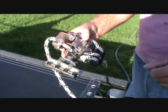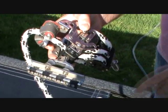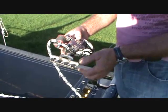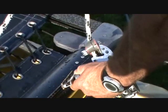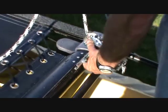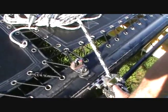When you're going to put the traveler onto the back crossbar of the Hobie 16, remember, some boats may have the traveler already on the crossbar, and some will not. In this instance, we're going to take the traveler and put it onto the back crossbar. Bear in mind, the boat we're looking at here has an integrated back crossbar — some of the older boats might have the older track system. We're going to pop it onto the back crossbar and slide the car into the center of the back crossbar.